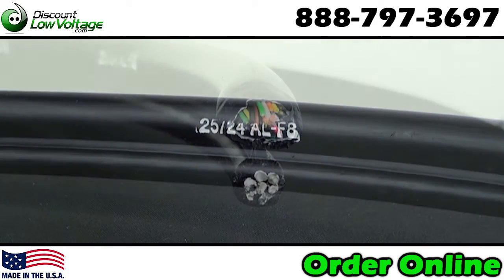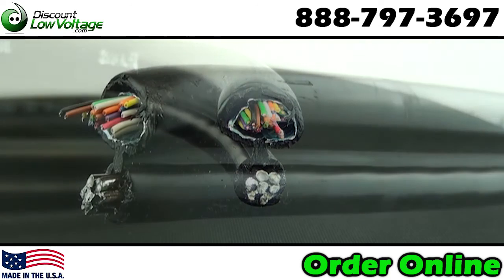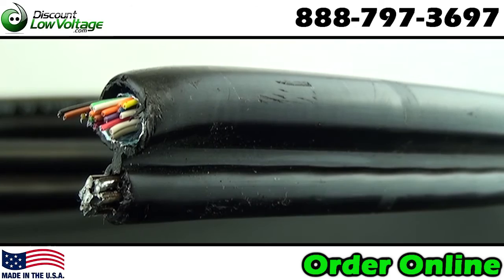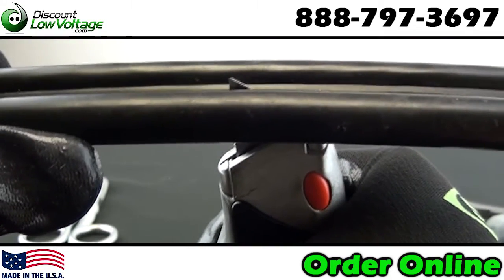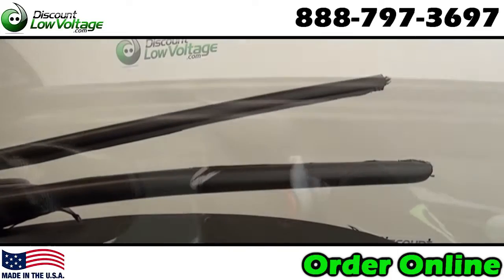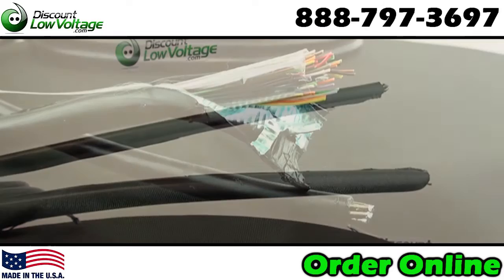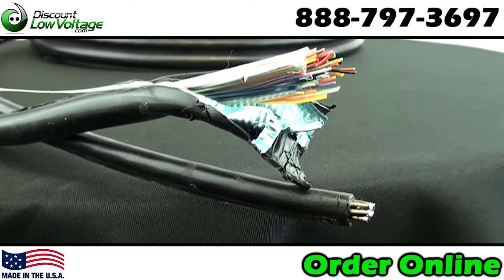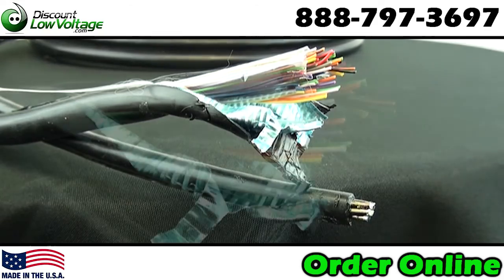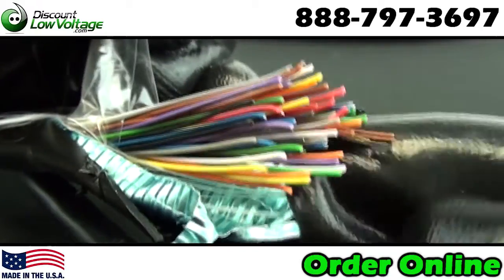The intended applications for this cable is for aerial installations. You have a copper conductor, 24 gauge. The insulation consists of a solid high density polyethylene, color coded in accordance with telephone industry standards, and you have tape applied with an overlap. There is an aluminum shield and you also have a dielectric tape applied with an overlap.